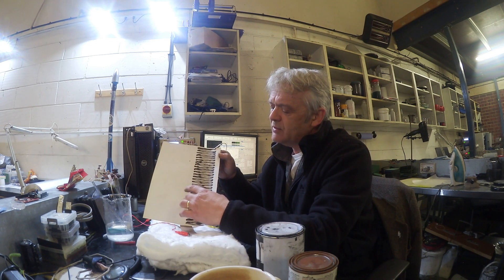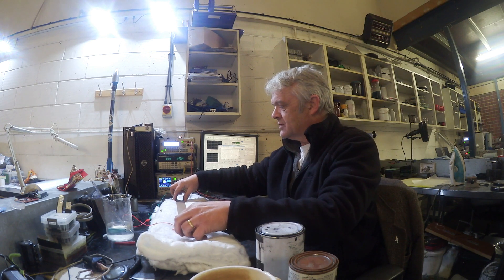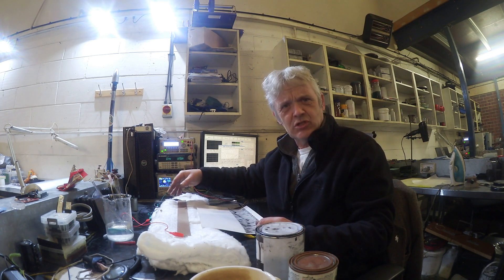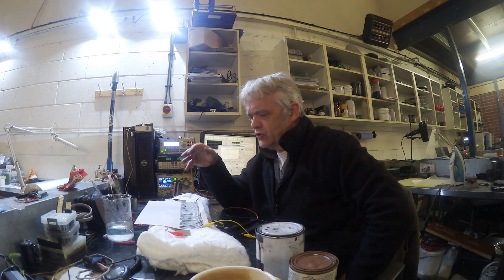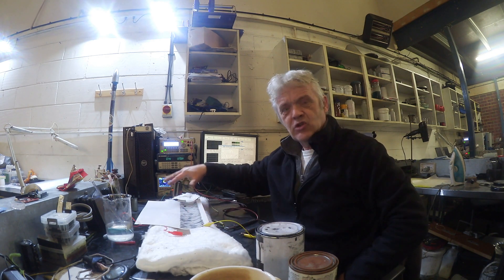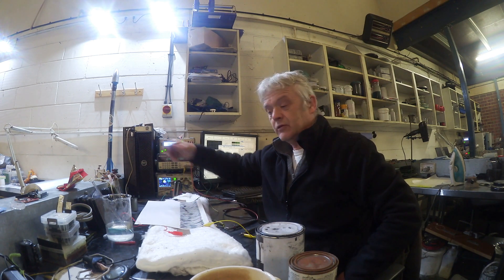It's quite broad, so the resistance is quite high — we'd have to think about bringing it a bit nearer somehow. Now, as you know, we're terribly cheap skates here so we never turn on the heating, and the surrounding temperature is about 10 degrees centigrade. What I've got here is a bit of kanthal wire attached to my power supply — I'm going to put a few amps through that, about 10 volts at 3 amps — and that'll raise the temperature. I've put the thermocouple onto the kanthal wire on one side, because that's going to be the hot side. The other side I've left on a woolen insulating blanket at about 10 degrees. So this side should get a little bit hotter, this side should stay cooler.